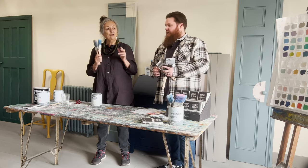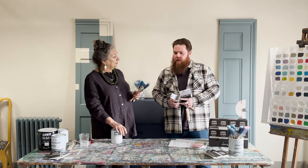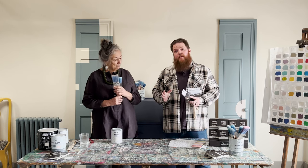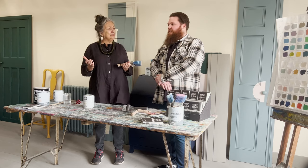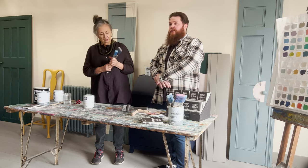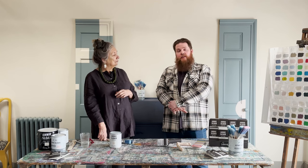So you've painted your piece, everything's looking gorgeous, you're really happy. Now the big thing you must do is wash your brushes quickly — it is not chalk paint. How long does it take to completely cure? It will dry very quickly within an hour or so, but to go fully hardened and cure properly it will take up to 14 days. That doesn't mean you can't go near it — it will feel fine — but don't put a big heavy thing on it. For cleaning, use a nice mild detergent or a little warm water. As soon as it's cured, it's as tough as it can be.